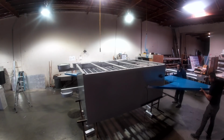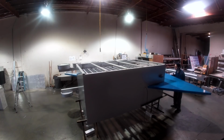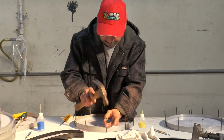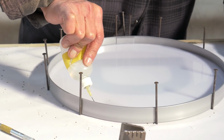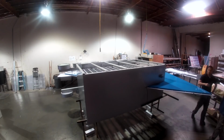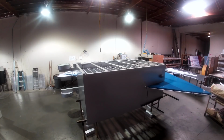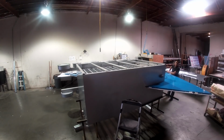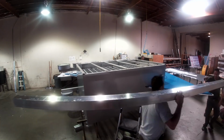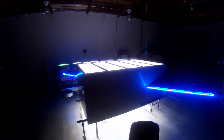The SignDawgs begin to assemble the massive sign they've been constructing for Viridian. Built in smaller, more manageable sections, it's time to begin assembly. While one team is assembling the larger body, the faces for the side are glued together and another team begins to assemble the neon portion in place. Once that's done, they finish wiring and test the sign. This portion of the sign is illuminated and left to complete the burn-in phase that sets the neon up and ensures there are no flaws, flickers, or leaks.